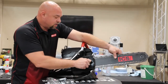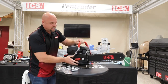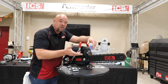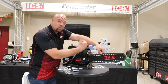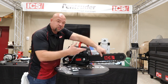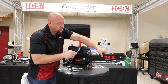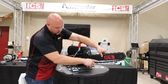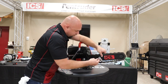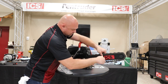Your side cover should fit flush front and back all the way around. Now, chain tightness — we run these chains a little bit looser than your conventional wood cutting chain. The reason why: it's a big beefy bar, we've got a lot of tooth on our chain, and we've got a lot of slurry and debris. So when we tighten this chain, first thing, just like a wood saw, we always lift our tip. Small adjustments to this screw on the front make a big difference, so it doesn't take a whole lot to tighten these chains.